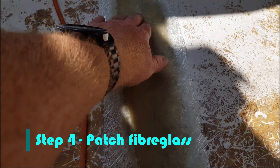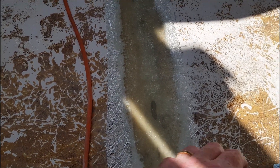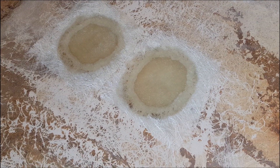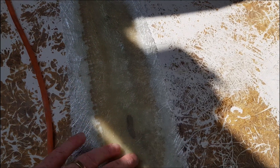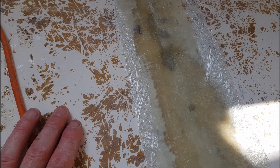This new layup is now curing, no tack, which is nice. I'm going to give it another 20 minutes, half an hour, just to see how it settles in. The osmosis holes aren't setting up quite as quickly, but I didn't put as much accelerant in those — that's fine. The layup looks good. They all need knocking back to the edge so that we get towards a flat surface, and then I will be mixing up some colloidal silica to fill that in and make good, and the same on those when they're set up.